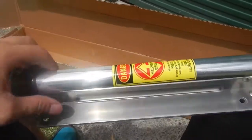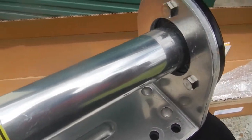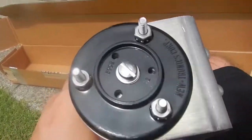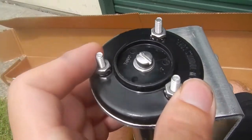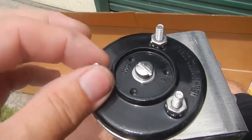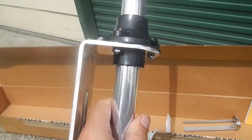This is the base of the antenna. Everything construction-wise is looking pretty good. I know that this doesn't have an SO239 connector on it and that's okay — we understand that. One question I had was what's the feed scenario at the bottom. Obviously this is for the center of your coax, and this is for your shield or your ground. That's pretty easy to knock up. For testing I'm probably going to leave it open for the time being, but later I might add a connector to make it easier when running different coax.